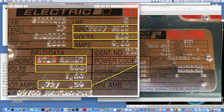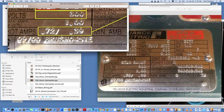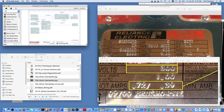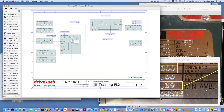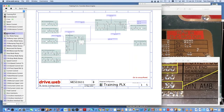It's a shunt wound motor rated at 300 volts for the field. We have the amperage for base speed, which is 0.72, and full speed of 2300 is 0.39. The armature current is 9.0 amps — it's a little Reliance motor, as you see on the nameplate. We're going to need that information when we get into the actual commissioning of the drive.